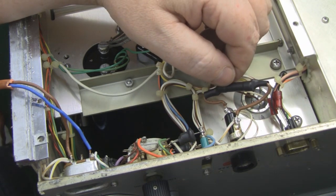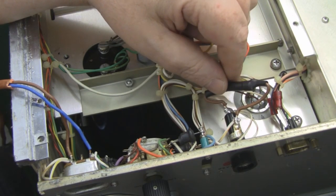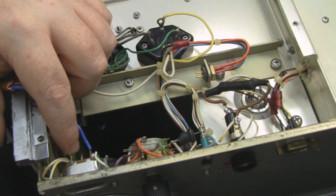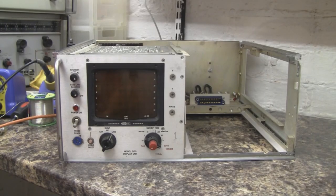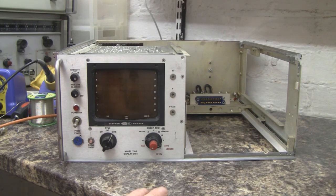I've made a jerry-rigged fuse with two wires soldered at each end of a fuse, wrapped in heat shrink tubing, and soldered into the original fuse connections to bypass the missing fuse holder. I've also soldered on the mains connection wires and set the voltage selector switch on the back to the correct position. I'm now going to power on the unit for the first time. A variac would be very helpful here to ramp up power gradually, but unfortunately I haven't got one — so we'll keep our fingers crossed.